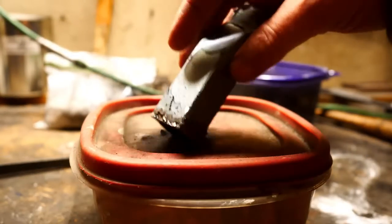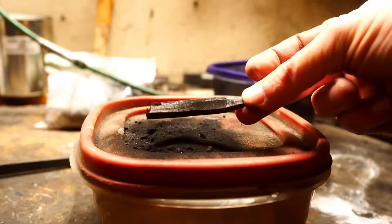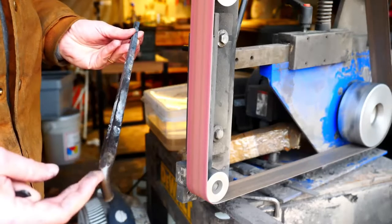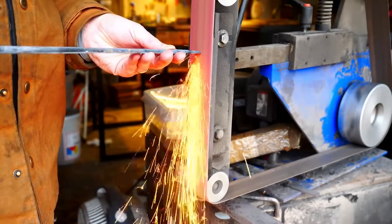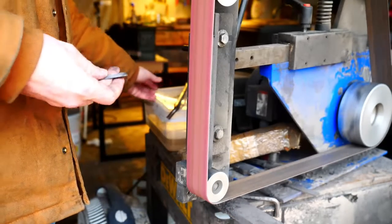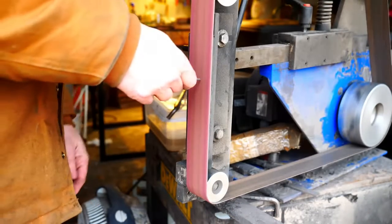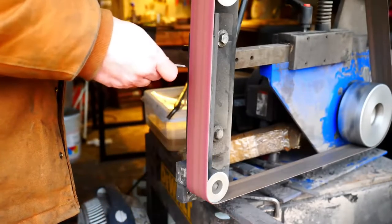If this model is a cold-pressed 1855 version, then the steel was probably made in England through the cementation process of iron. Whereas if it's an 1873 original, the steel might have been made by the Bessemer process, which became commonplace in the interim. In any case, the steel for these bayonets most likely came from England and was imported into the United States.